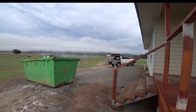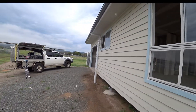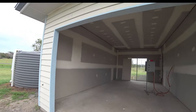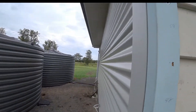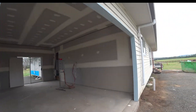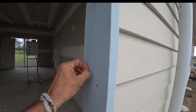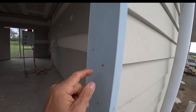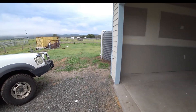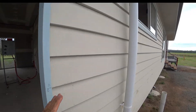It's a reasonably big house. I'm just going to do this one by myself and it'll probably take a week and a half to two weeks on the outside. Not sure exactly - we'll see once I start. There'll be a lot of gapping and caulking to do. We'll just use putty on these ones here - they're not big enough to use a two-pack bog or a builder's bog. We can use putty on them, but we'll have to double putty them - putty in once and then put a very slight base coat over them.